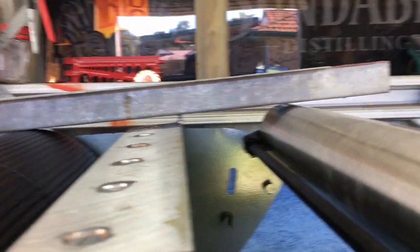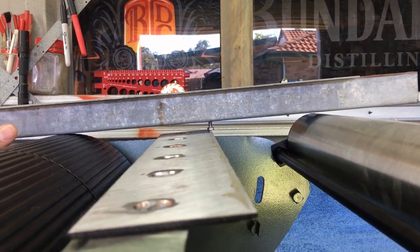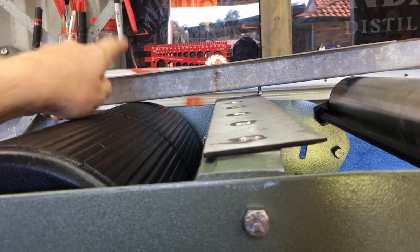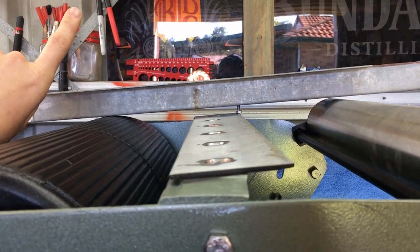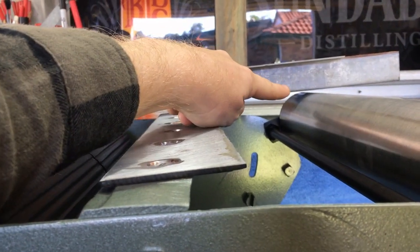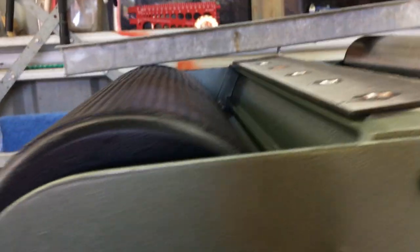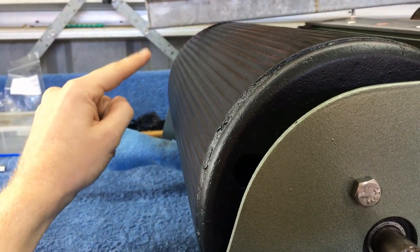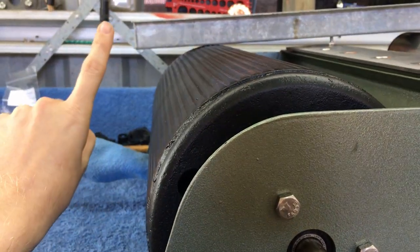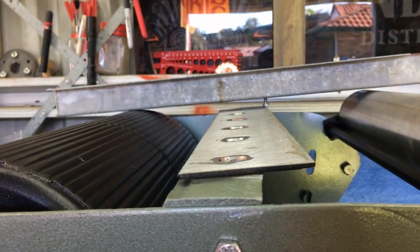Now repositioning the height of cut bar to the other side - you can see we have a gap underneath the front roller. What that's telling me is that this part of the rear roller needs to go up. As it goes up it'll raise that bolt and eliminate that gap. So our pivot point is under here - I'm going to loosen those nuts, press down on my pivot point, raising this roller until we're just touching in the same position on the far side.